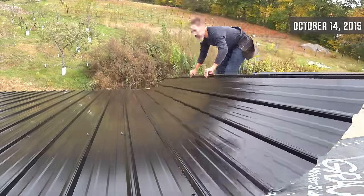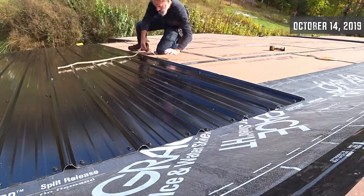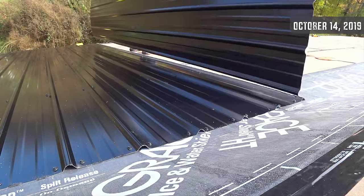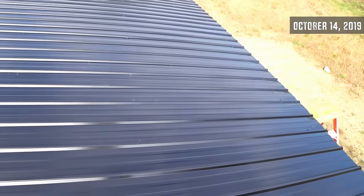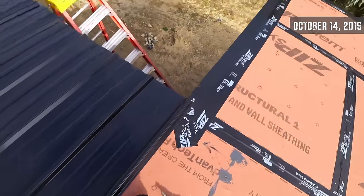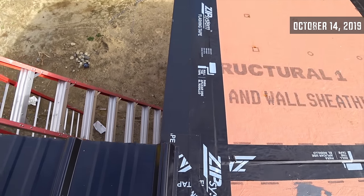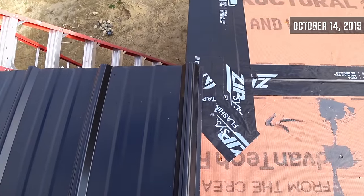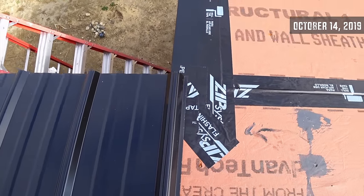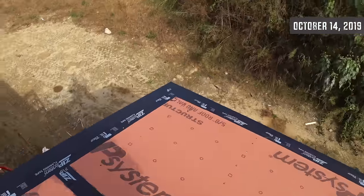On the edge of each panel before the next panel overlaps the final rib, you're supposed to put this rubber butyl tape on the seam, and it's supposed to help keep water from going underneath your panels. I've never seen anyone installing a metal roof put this rubber stuff on, but it's recommended by the manufacturer. It's like sticky silly putty, and that's supposed to close up the seam. It adds five minutes to each panel — it's a pain. So things pretty quickly fell into a rhythm: bring up a panel, lay it down, screw it off, add more tape, bring up another panel. And that right there is math — just about perfect, it is perfect. Now I can put a full long sheet on right there.